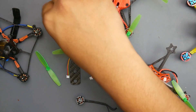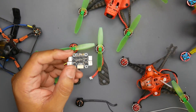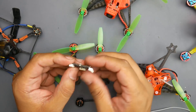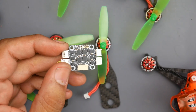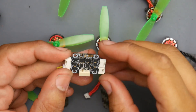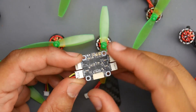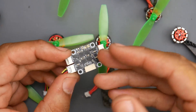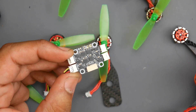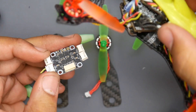There are a couple of interesting things you should know about ESCs. For the ESC, I was using this one right here — it's found on the full speed toothpick and I think it's rated for six amps. What's really crazy about this is if it exceeds six amps, it'll shut down the FETs — it won't burn them, it'll actually shut them down until they cool down. Then it'll just use another ESC. By that time everything is cooled down and it goes back to the other ESC. That explains why the quad didn't burn when it was stuck in the tree.